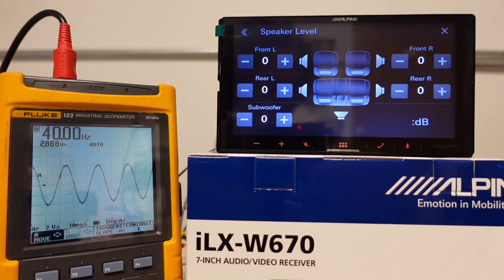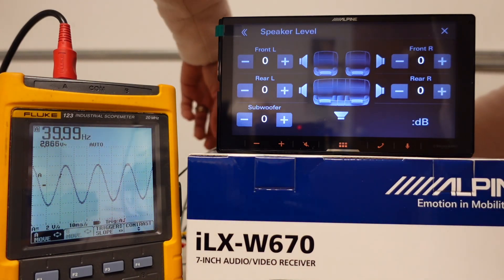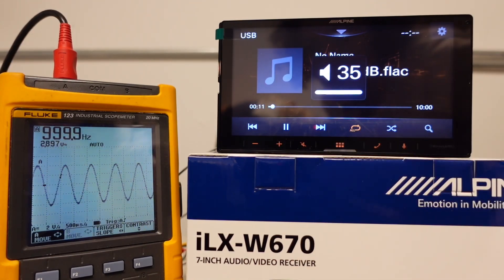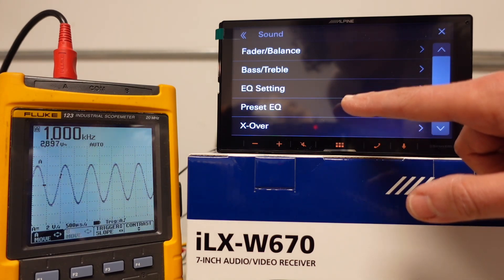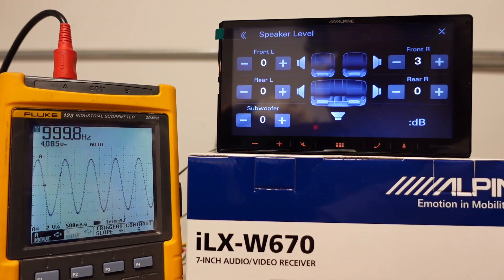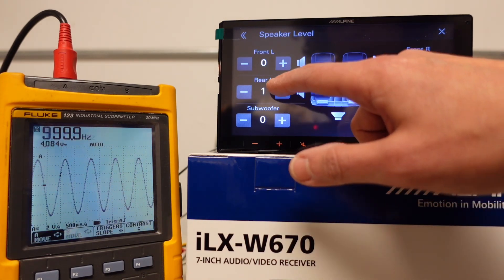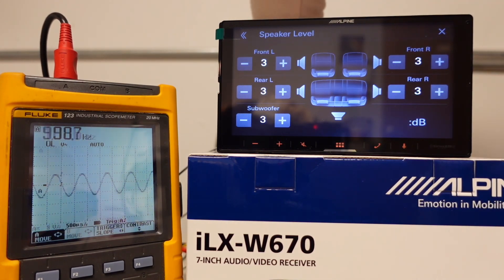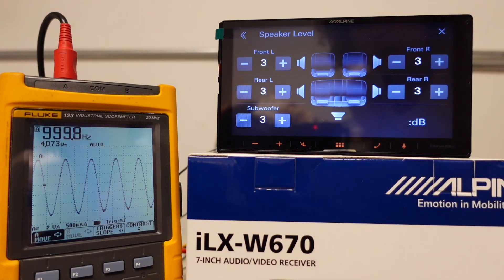Let me put that back to zero and switch this to the front pre-out; let's see what we get there with a different test tone. We have 2.896 volts — I'm still maxed out. Let's go into the audio setting menu. Is it also going to need to go to plus three? Yes — plus three and now we have four volts, totally clean. I'm going to assume we're going to have to do that for everything. Plus three on speaker level. Let's switch it to the rear — yep, same thing. So: subwoofer level at max 15 in the subwoofer level menu, plus three on all speaker levels, max volume 35, you are getting four volts and that wave is super clean. This is a great value at $299, just like the 650. That is hard to beat.